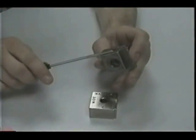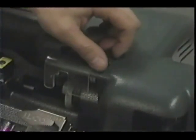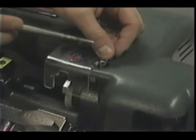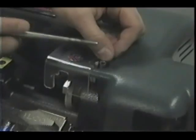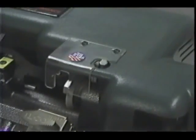It is important to keep the moving parts lubricated. An oil cup is provided to keep the cutter shaft bearings well lubricated. Five drops of lightweight machine oil is sufficient for the oil cup. If you are cutting 30 to 100 keys per week, oil should be added to your key machine every three to four weeks. If you are cutting over 100 keys per week, add oil every two to three weeks.